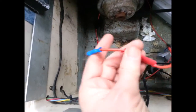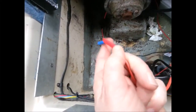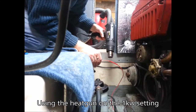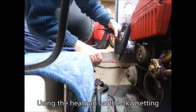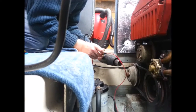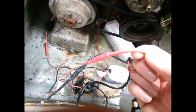Put a new connector on this time, and here's the heat shrink sleeve - I'm just going to slide it into position. Here are the results after using the heat gun on the lowest heat setting - as you can see, that's quite a neat finish.